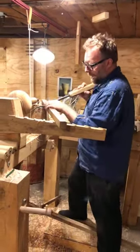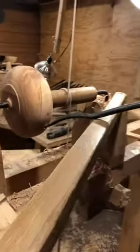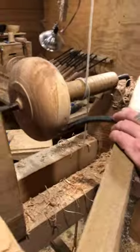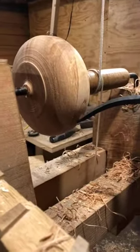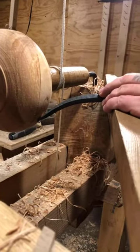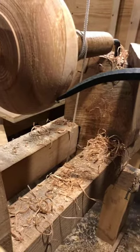With this bent shaft tool — and you can zoom in closer — I can turn deeper, turn the cut deeper, drop it even further, and I can still skew. So I can turn deeper and skew at 10 degrees.